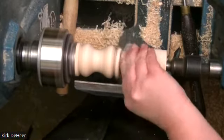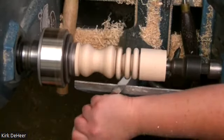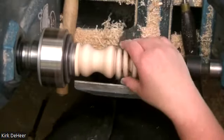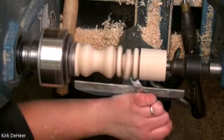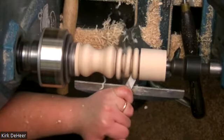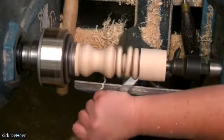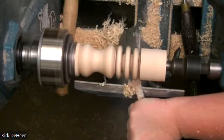We're just going to touch it with a little bit of sandpaper because this is a really pretty piece of wood — this isn't just a regular demo piece, this is going to be a pretty pretty rattle. The second ring has parted through. It's looking good. A couple secrets as you continue to do this: as you part your rings off you're going to have little pieces underneath your ring because those don't always part off smoothly — that takes practice and time. My favorite thing to do when that doesn't work: take a hot glue gun and a piece of sandpaper, attach it to the spindle, and that will allow you to sand the inside of your rings pretty close to perfect.